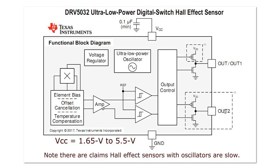In other words, here is your hall plate, here is your differential amplifier, but you've got two differing Schmitt triggers that are biased, where the north pole will switch one side on corresponding to output one, and the south pole will switch on output two. It does not switch on both at the same time.